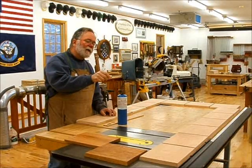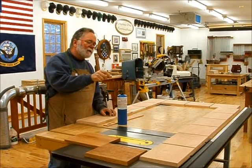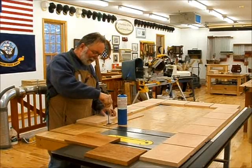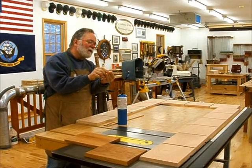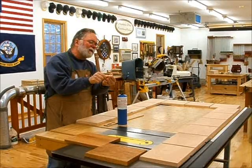Heat it up with a propane torch. You get it until it starts changing colors like the colors of the rainbow, and then you keep heating some more until it sort of keeps that bright brassy look to it all the time. Then you test it out on a piece of scrap, and if you like it, you start branding. And you can do a bunch of boards with just one heating like this.